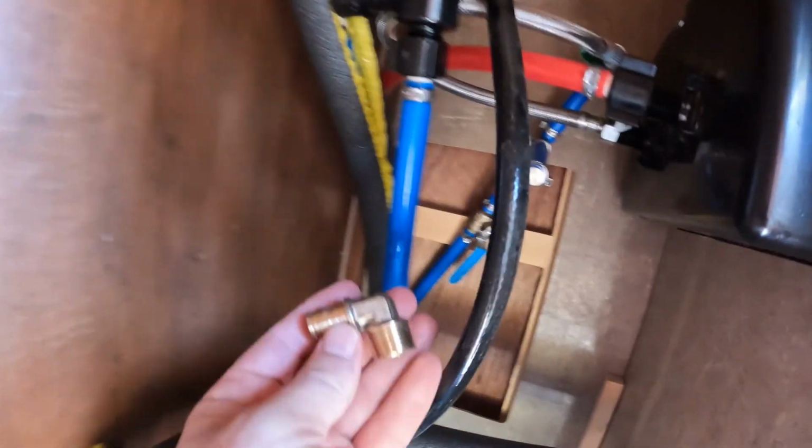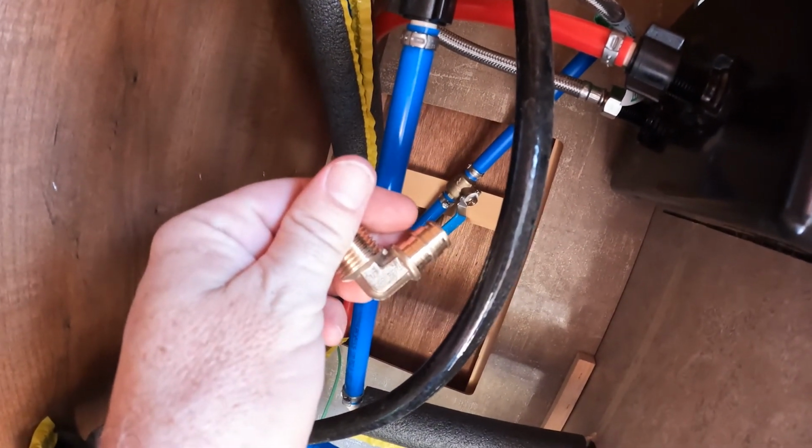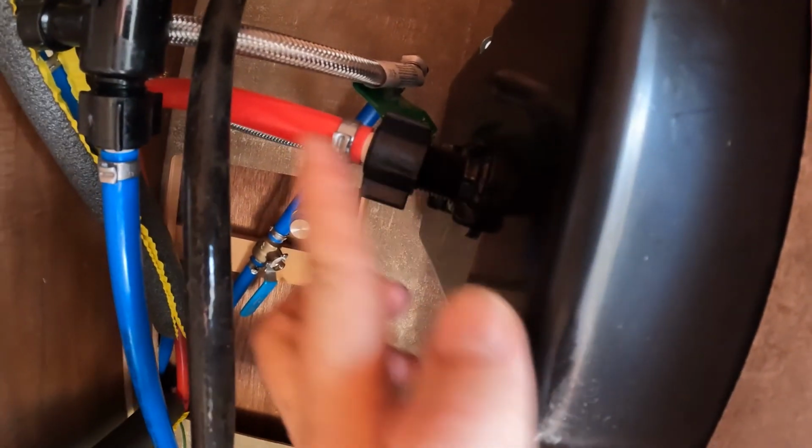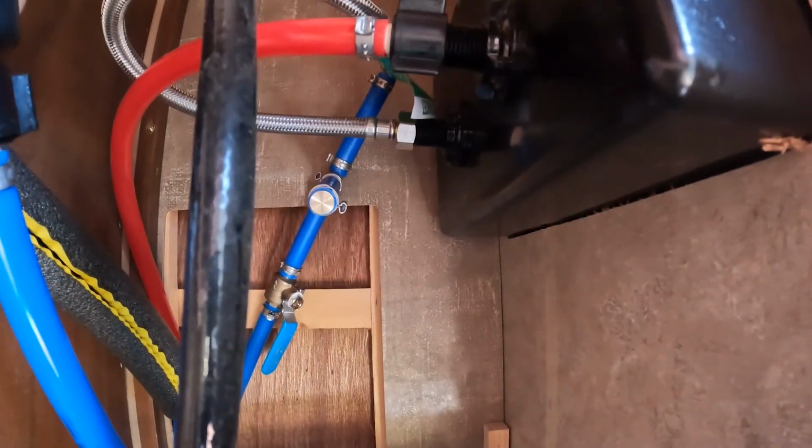If you have one of these in your RV, I would just suggest you cut the PEX, put a right angle, one of these guys with a male end, and a half inch, not this, I did too large there. And then buy you one of these and go from your PEX to here to prevent this angle that's going like that instead of 90 degrees, because of all the tension from the PEX. If you look at it, the PEX is just worked around there really hard. The blue one was like that too, but worse. That's why it broke the seal. Bob's your uncle.